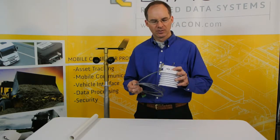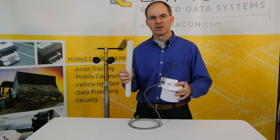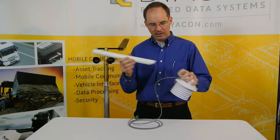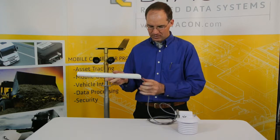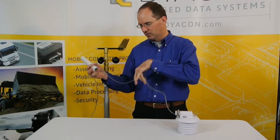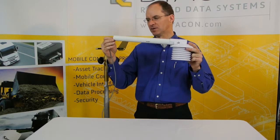The mounting system on the Diacon air sensor TPH sensor is somewhat unique. The device is designed specifically to be mounted on a one-inch pipe — either aluminum or PVC. This allows for the device to be extended beyond any structures that may affect the temperature. It also allows for the cable run to be protected by routing it through the mounting pipe, similar to the feature we have on the wind sensor. In this configuration, the cable is fully protected from any rodents and any other obstacles that may damage the cable.